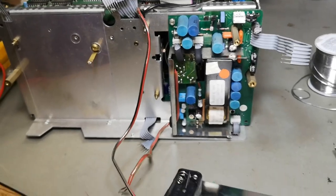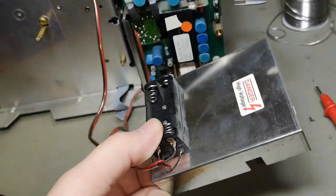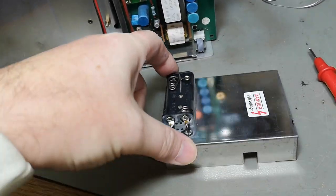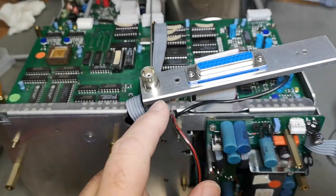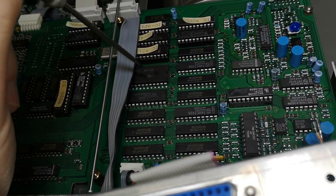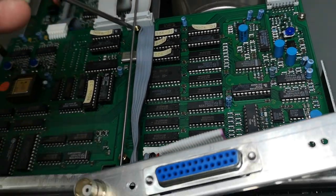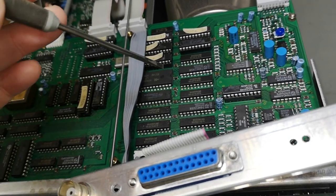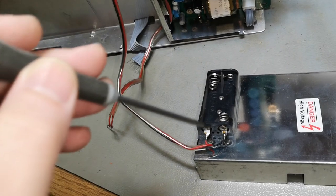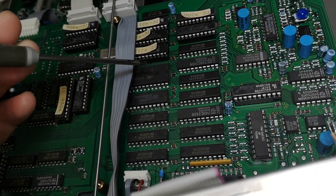Let's assemble everything and prove it. And those two little battery cells — I also looked that up. Why didn't they add a label here explaining what this is doing? I think it's quite obvious: this goes to the digital board, and in the digital modes for hold storage there is an SRAM here that holds the stored picture in digital mode. So if you want to store a picture and investigate it tomorrow, you can power off your scope and it will still remember your curves if you put in a battery. That is just the most sexy feature in a scope from 1995.